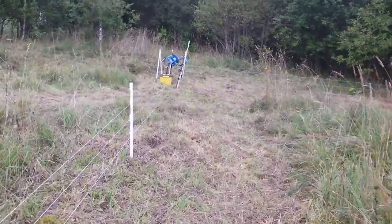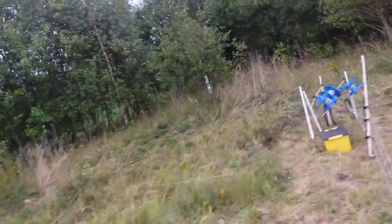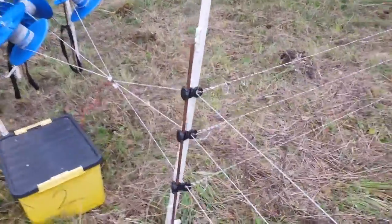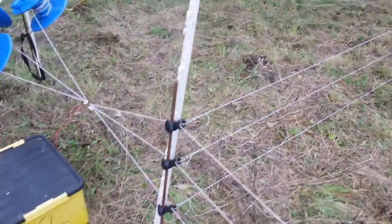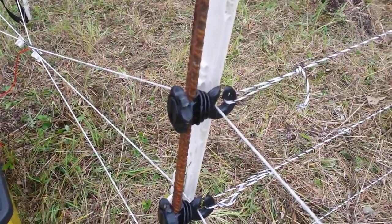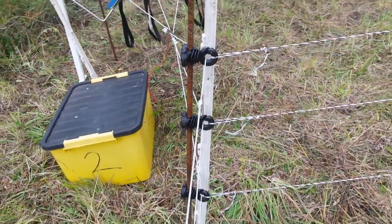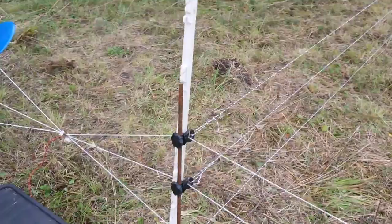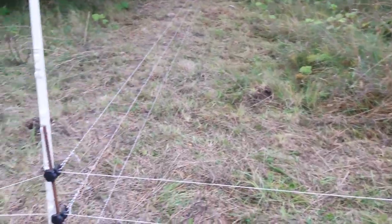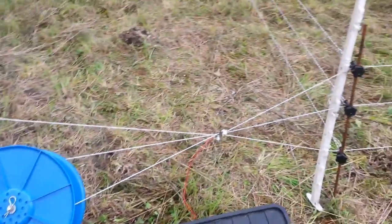You can see how tight this fence is - keeping 500 meters of wire tight is a tricky thing. If it's poly wire it's basically plastic, very elastic. You can see a traditional corner here - that's the inside of the fence, that's the outside. The beginning of the wire doesn't touch the ends - that's important for debugging purposes if you have somewhere the fence is grounding, vegetation is touching the fence, or the line has been run down or whatever.